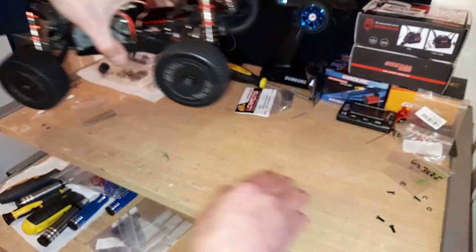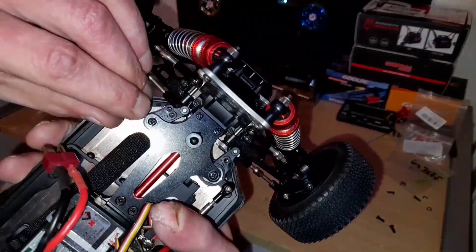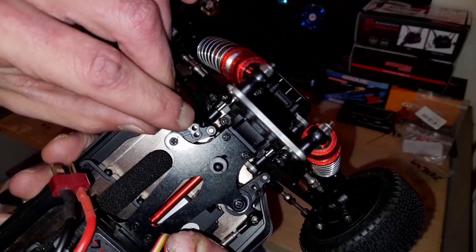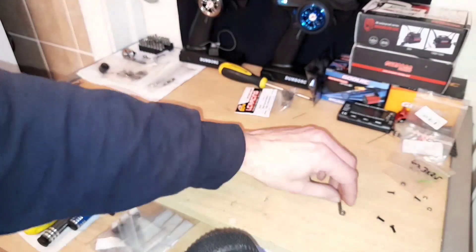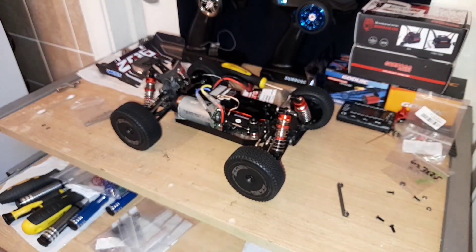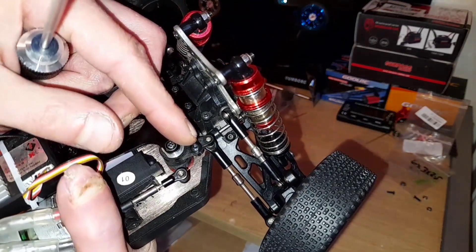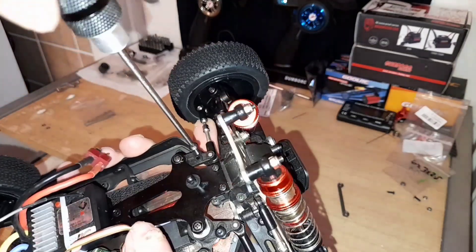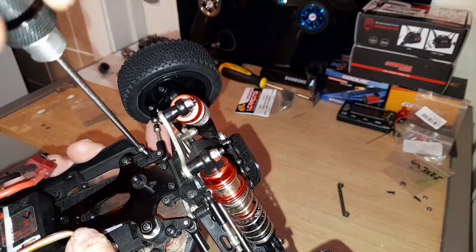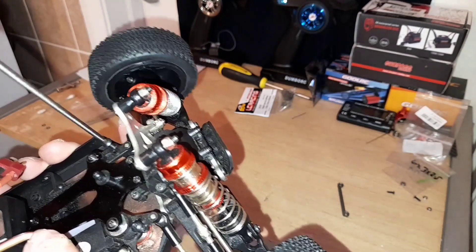Which means you've got to drill this out — just drill the two out of four holes. This side I've already done, and as you can see there's plenty of plastic on there for you to get a thread on. So I'm just going to drill this one out too. Once I've drilled it out I'll just start setting the screw in straight away, because it's easier rather than having the ball go across and having to fumble around. Keep it nice and steady, make sure you go in nice and straight.